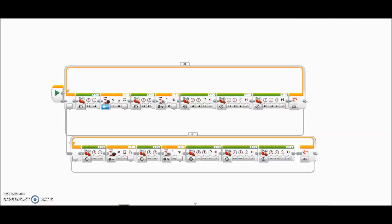Now let's take a look at the program. I'm on my LEGO Mindstorms software — it's already prebuilt. I used two loop blocks because I was using two different color sensors — one plugged into port three and another into port two. Once I start the program, the robot will spin at a low motor speed so the ultrasonic sensor has a chance to actually see something. If you spin too fast, it's like being in a car going fast and trying to see something — you just don't catch it.